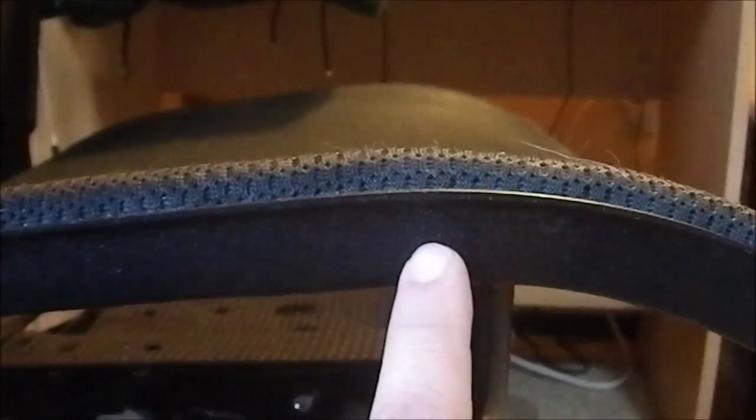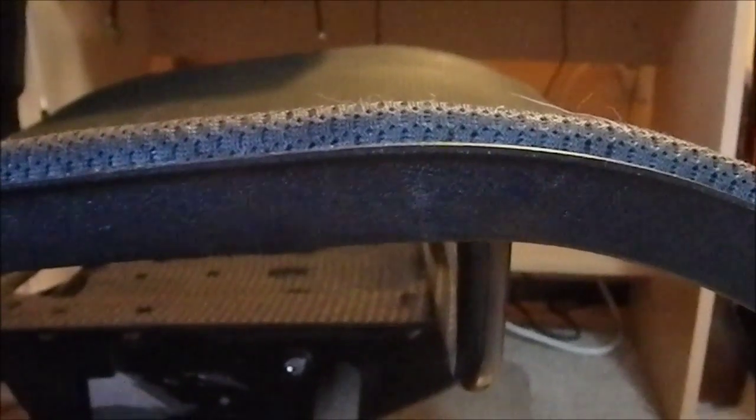I should be able to get a very small hole here and use a wood screw to go right in there — that's probably going to be a standard wood screw sitting flush in a chamfered hole. I also have some bushings I might be able to use if I want to grip the outside of the tubing and give it a relatively clean finish. I'll make sure to knock all the sharp edges off the tubing — if you leave a sharp edge, your cat is going to come up and rub against it, and you don't want that.